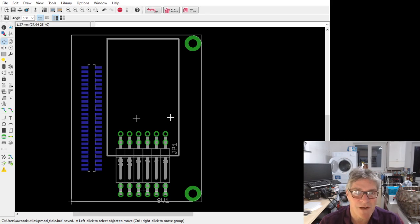I mean, if we can't think of anything, I could just pin them out on some headers or something. You didn't have to populate those, just have the through holes there so that people can solder them in if they need them. You know, use the old DuPont connectors for something, I guess.